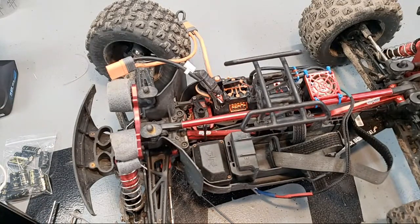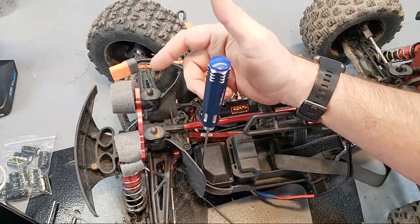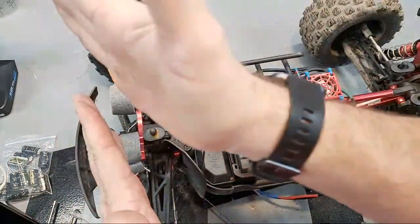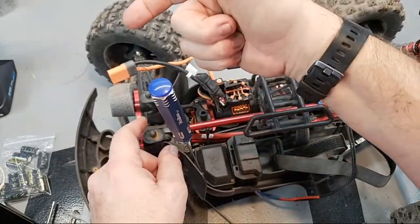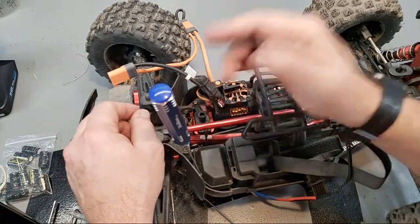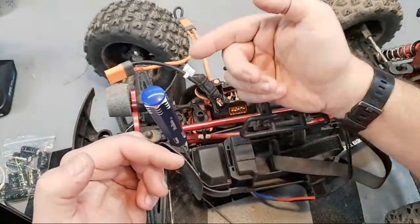Earl: Better to make your own if you can't find the correct board for sure. Right. It's not even finding the correct board. It's literally all you have to do is just get a regular board and cut it down. My impression is that you literally just score it with a razor blade a few times and crack it and break it right off. Then take it to a grinder and grind the edge. And then you're putting the leads through and bending them over on the back side.